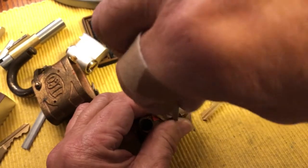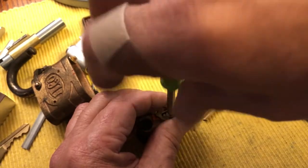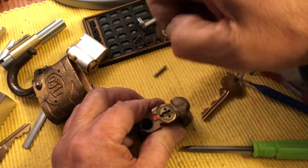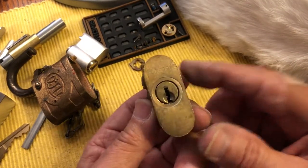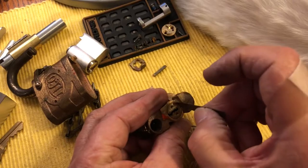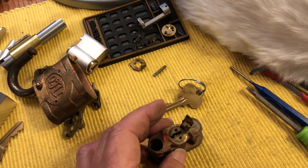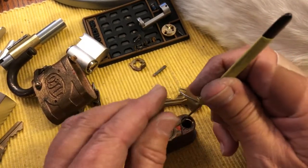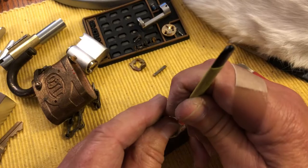So this is the other way you can make a key. Once you've figured out your blank and you've got this apart — remember, you don't have a key for this — so how do you get this out of here? Well, you've got to pick it or you have to shim it open. You can back shim this and come in here and take a pick and try to set these gently, shoving the shim in — and that works pretty good.